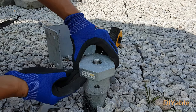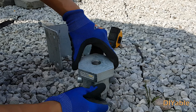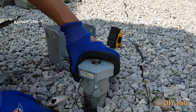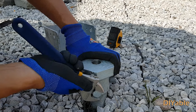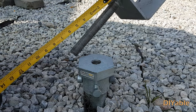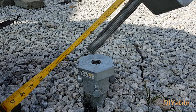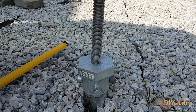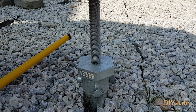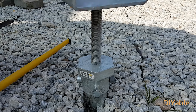As you see, they have two screws to prevent uplift. Now, there is one screw that is for making this head unit more stable. For the adjustable saddle, the whole length of the screw is 7 inches. I was told by the guy that you have to put at least 1 inch into the head unit. So, it gives you 6 inches of adjustable height. That's more than TechnoMetalPost.